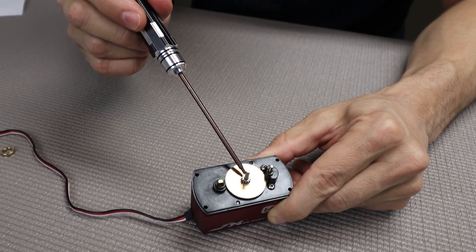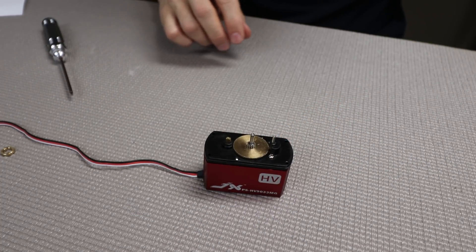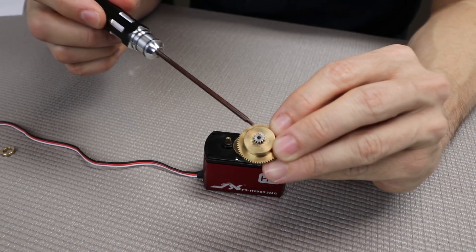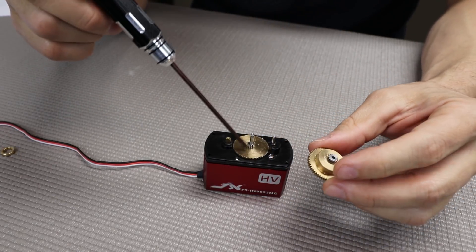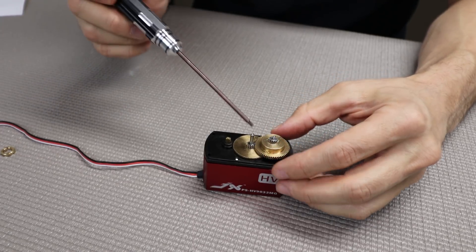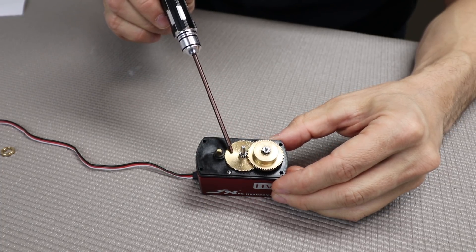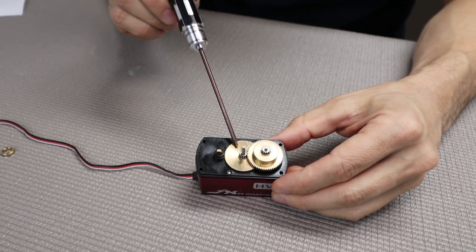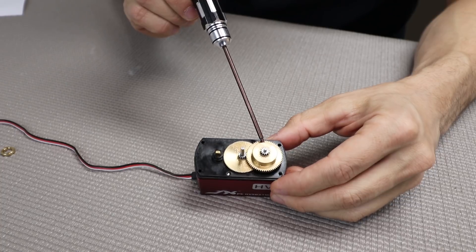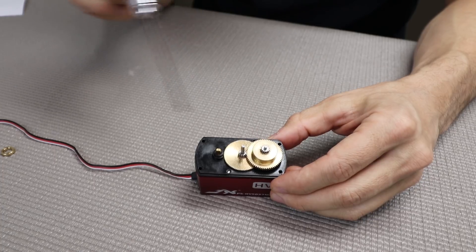As part of this gear it has another little gear inside the middle of it. So now this gear drives the next gear — same thing: large outer gear, small inner gear. This small gear drives against the next large gear. So in the first step from the motor to this gear we're building torque but we're also losing a good amount of speed. This drive gear driving this driven gear is again building a lot of torque in the driven gear, but we're losing speed between these two gears.